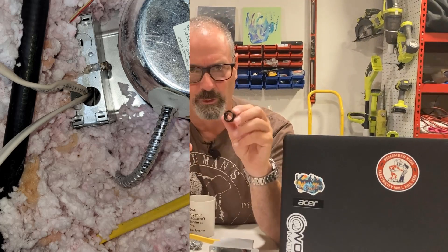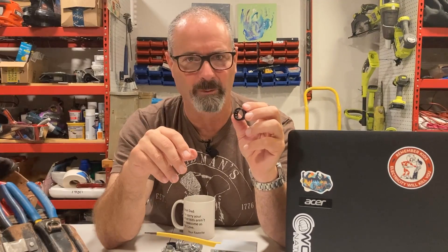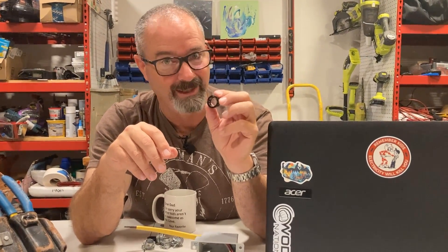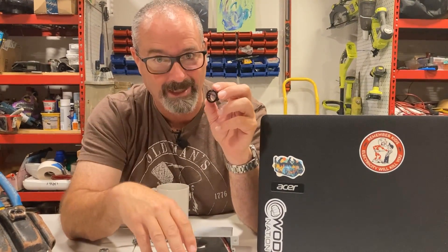That's my big problem — I've seen a boatload of it, mostly on cans. What is it with people installing cans and not putting in a grommet? It's not a college degree, it's not a nuclear transformer — it's a plastic donut. Put it in. You know what? It's painters and tile guys doing this. I know it is — I can see the little prints on the cans.